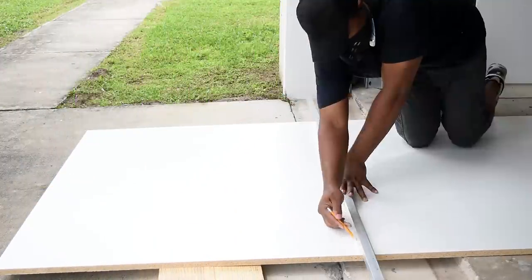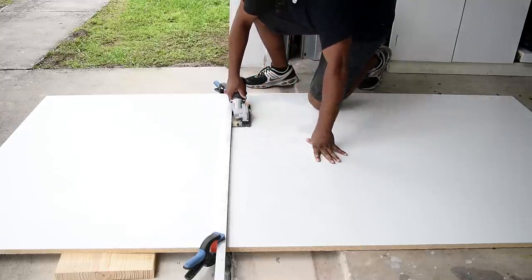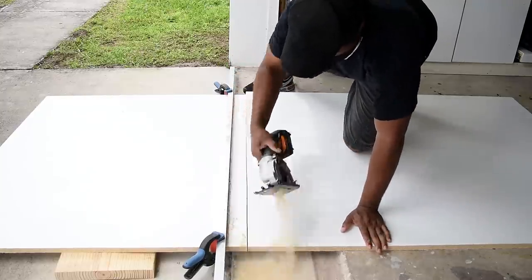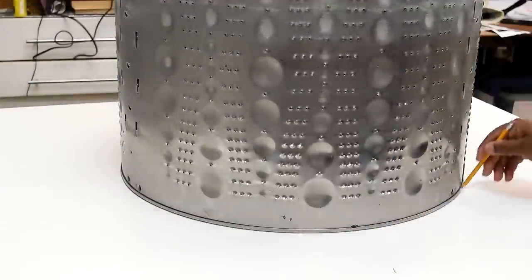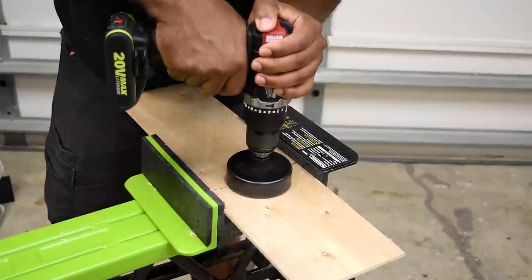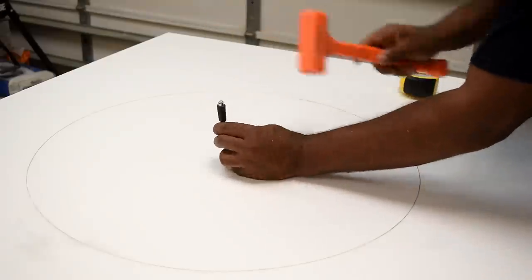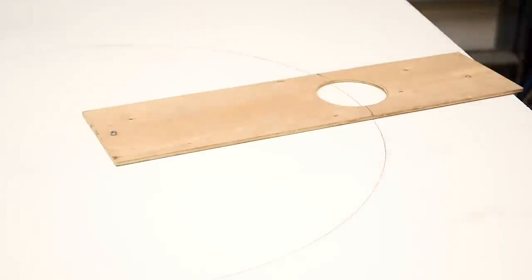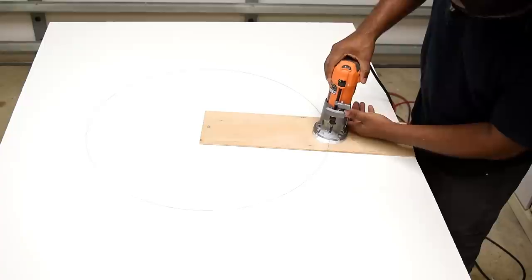For this project I used three-quarter inch thick melamine — this will be the foundation of the concrete mold. Depending on whether a project is pressing or not, I would put more time into thinking and planning so that execution can go a lot smoother. My thinking was to rout a few circles into the base. It turns out my hole saw is the same size as my router base, so making this quick jig allows me to make quick circles. It's really simple because I can just drop my router right into the hole without necessarily having to attach it.